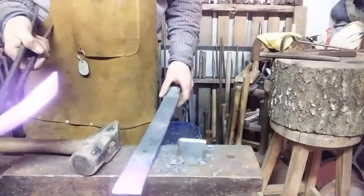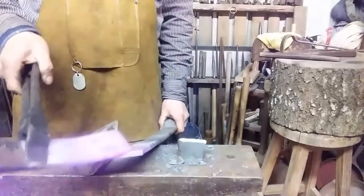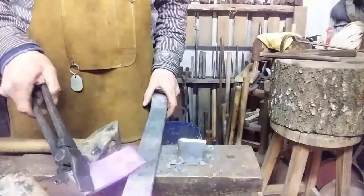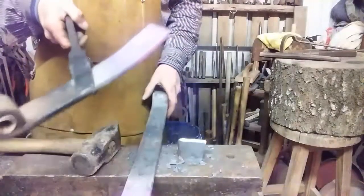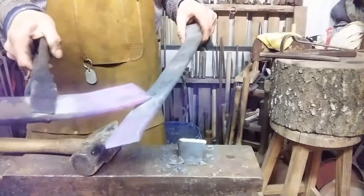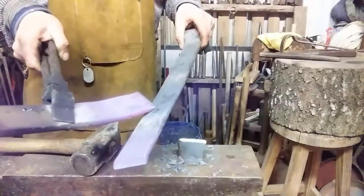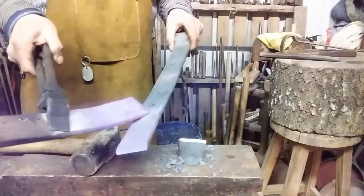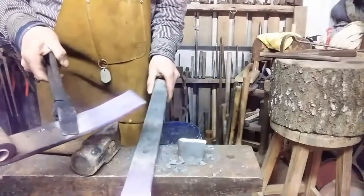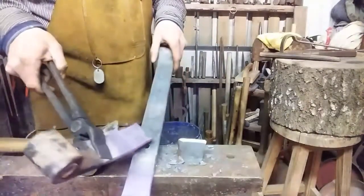And I'm not going to do that right now because having that notch in there might make this more prone to burn, because I have to heat close to it to get the indentation for the hole. So let me put this down in a safe location and we'll proceed with indenting the hole with that lozenge shape, because we have to make a V-cut towards the tip of the bar. That way when you slide over the nail head, you can pull back towards you and lift up and extract the nail.